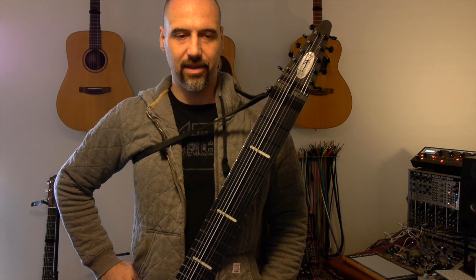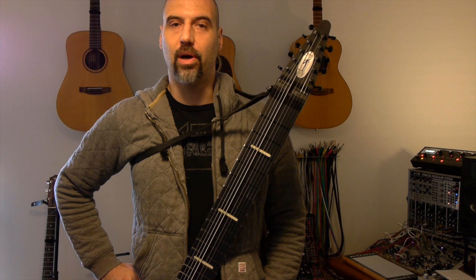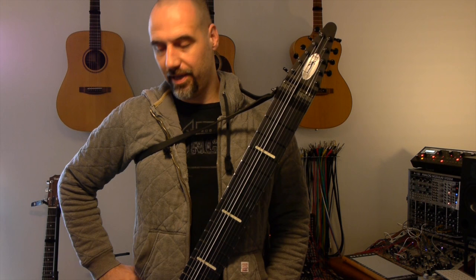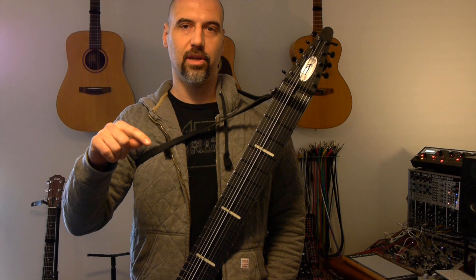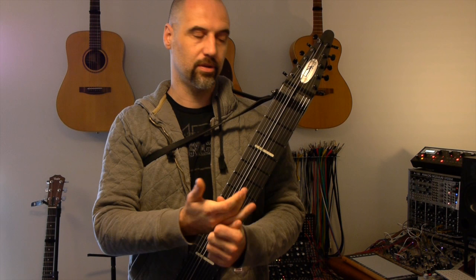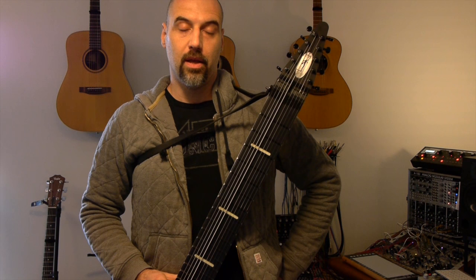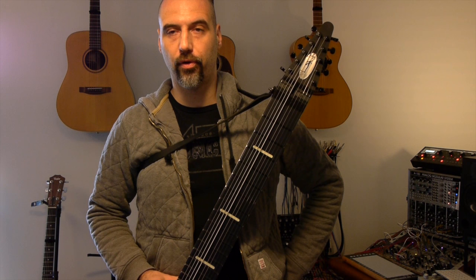What happened is that I blew a couple of my preamps — so that's going to be an expensive thing to replace. My Metric Halo devices seem to handle phantom power well on one channel, but when using multiple channels like this, it turns out that when you insert the TRS jack there are several locations where it bridges the connections, combining those two voltages together, which can cause your preamp or capacitor in the circuitry to blow. Stick Enterprises had never heard of this, but Metric Halo confirmed it could definitely create problems.